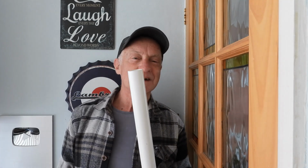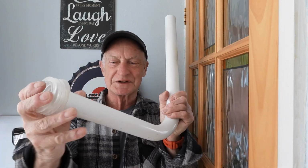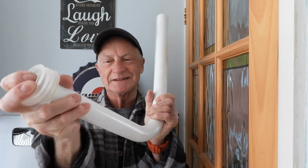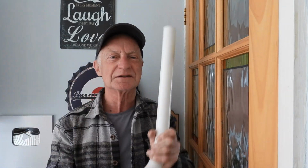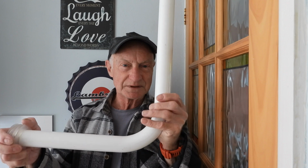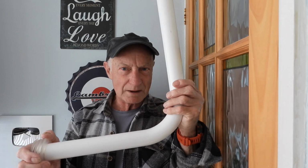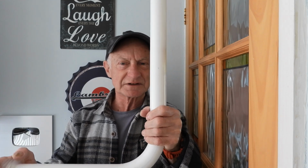Anyway, looking at these, what's the main source of leaks? Well, usually this is the rubber insert that goes on the back of the pipe here, slides over. It's always tight going. It goes in like that, and that goes in the back of the WC pan. Quite often what can happen is this pipe, when it's fitted in the very first instance, gets cut too short. When that happens, this pipe would always want to fall out the back of the pan with every flush. It's not right in tight and rigid, it just keeps easing back out until it starts to leak.